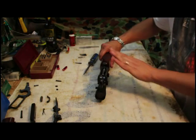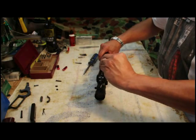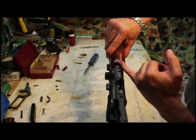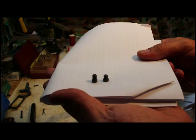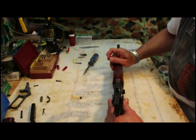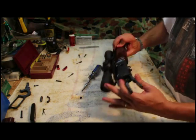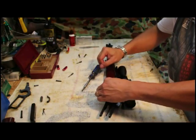Now we've got to put the trigger plate back on — remember that takes two screws, one at the front and one on the side. That comes up in order to line up with the hole here, has to be right up against the timber on the forend. The longer screw goes to the bottom first — you do not snug it, just thread it and let it rest. The side support screw, which is the shorter one, goes in on the side.